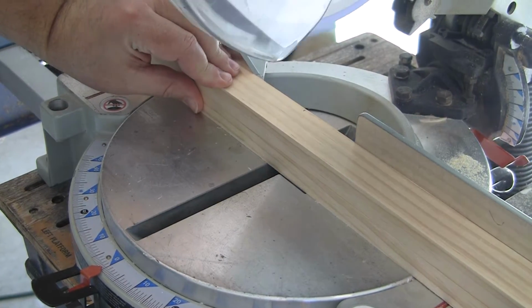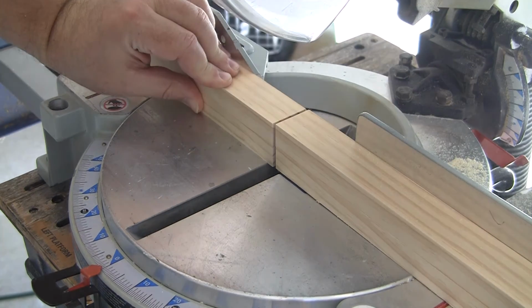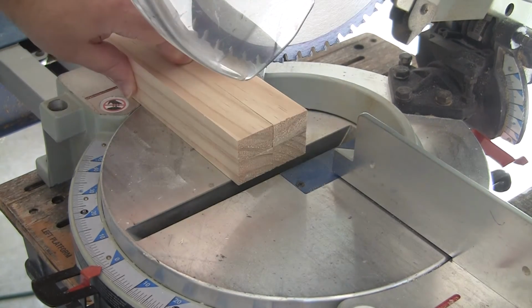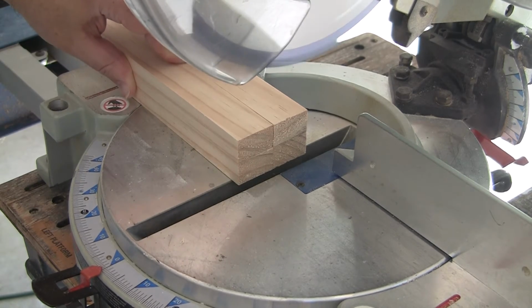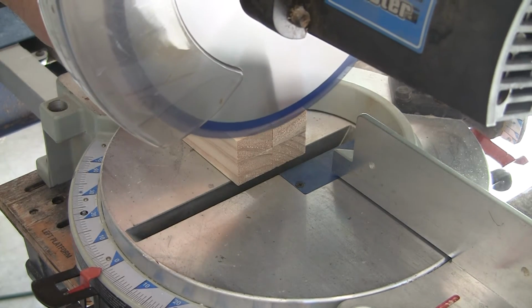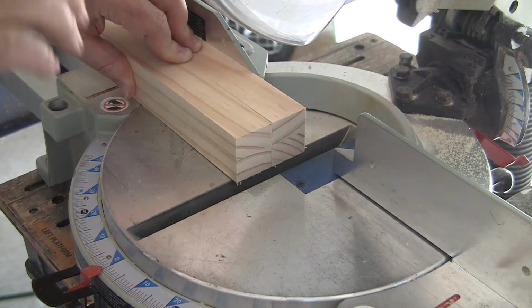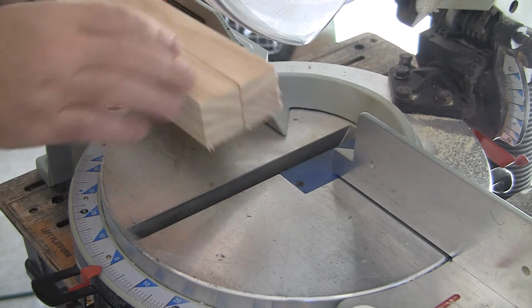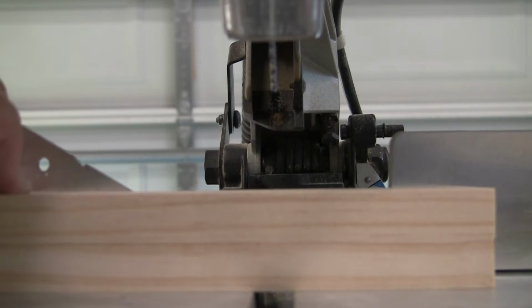Take the 2 25-inch boards that are 1 1/4 inch and cut them in half so that you'll have 4 12.5-inch boards. Now take the 4 20-inch 1 1/4 inch boards and simply clean off the edge so that they're all exactly the same length. This gives you all of the boards needed for 2 bulletin boards for the backing, which will hold it off the wall. This will make more sense once we start the assembly process.